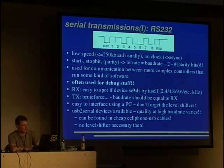One might have seen the console hacking thing, so even the DVD-ROM of the consoles has RS-232. And one can patch the firmware with it. One wouldn't think of this, but this is the way they do it.